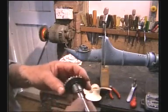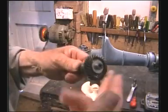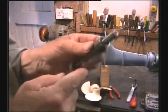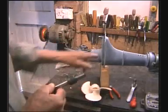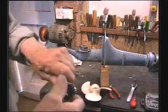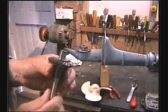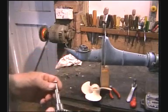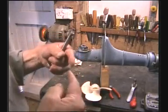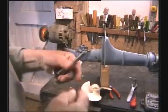The little pinion or planetary wheel that comes down there was equally as clean. Then I realised how the thing worked. This actual wheel on the shaft just simply rotates on the shaft and imparts no drive to the shaft whatsoever. But it sits within a spring, and this spring has got a little tab out. There's a little bar that comes down past that piece, and depending on the rotation of the spring to the drive, it either bites or doesn't bite. It's a form of clutch — the best way of describing it is the Chinese finger puzzles, where you put your fingers in and if you pull them out it grabs tighter and tighter. The only way to loosen it is to go the opposite direction. That's the principle.